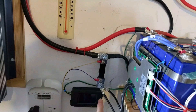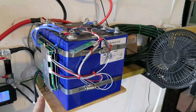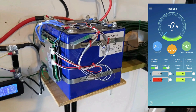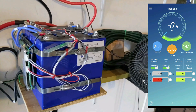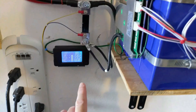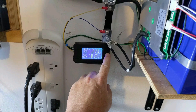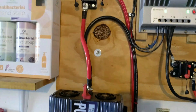The battery BMS has Wi-Fi capability, which allows me to read parameters and battery status in real time via an app on my phone — I'll put a screen cap up for you to see. It's a nice feature, though not strictly necessary if the BMS is working properly since it controls itself. If the BMS happens to fail, I do have a backup in the system: a battery monitor. So if I don't have my phone or the BMS breaks, I can do a quick status check just by pressing a button.